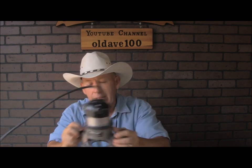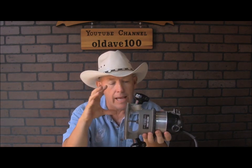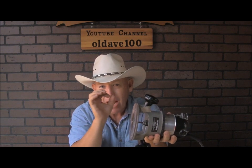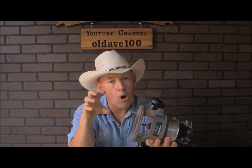But what we found, and Dad taught me this, is that when your router's bearings start going out, I'm going to give you a sound of what that sounds like. Hear that sound? That means the bearing's going out. Now, I'm still using this router, and I'm going to use it right now for the background. But I would never use a router that sounds like the bearings are going out when I'm doing profiling or anything detailed. Because if you think about it, those bearings are getting worn out. So that shaft, minutely, is actually moving. And when that shaft is moving, even if you were looking at it under a microscope, it's going to be really hard to hold a straight line.